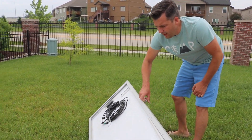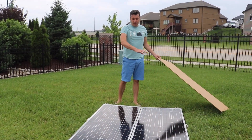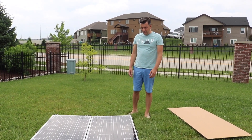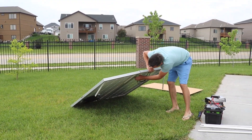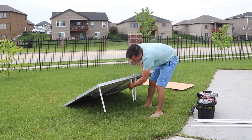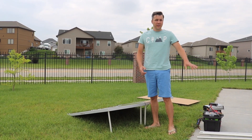To open it the long way we go ahead and do it this way. There's just cardboard that I cut to protect the glass. If you're just laying it flat on the ground then you're good to go right there. If you want to angle it, there are little PVC legs that fold up underneath. Tilting it is going to be more efficient for bringing in more sun to the solar panel and sending that energy to the battery.